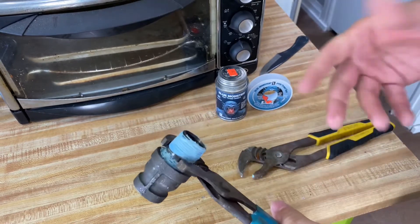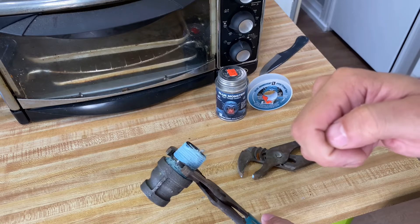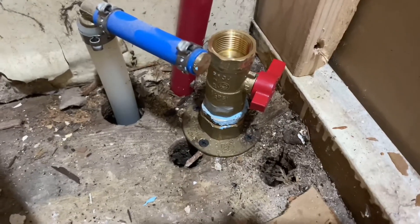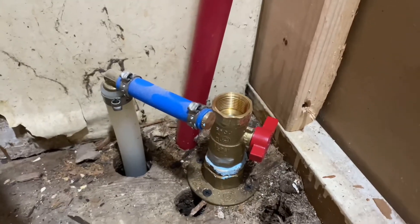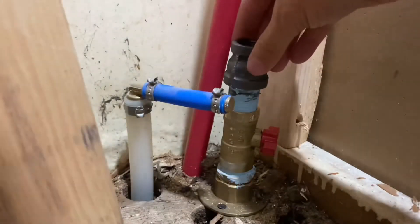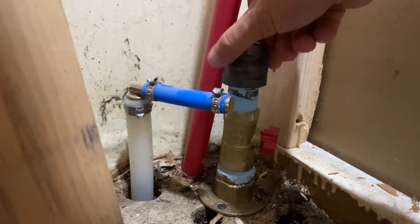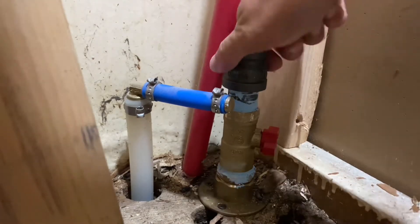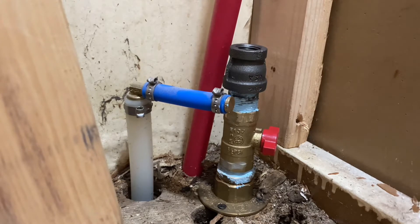Now what I'm going to do is show you how I connect this to the actual gas line that's three-quarter inch. Here's where I'm going with it right down here — that's a gas shutoff. Below that gas shutoff it comes out of the floor through that floor flange, and we need to go from three-quarter inch down to a half inch off that shutoff now. Righty-tighty — and don't cross thread anything. Get it on there hand tight first to assure that you're not cross threading anything. Now I'm going to use my channel locks to tighten that down.